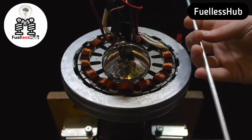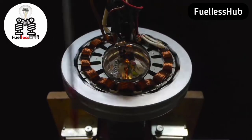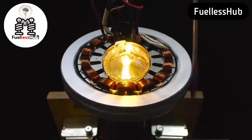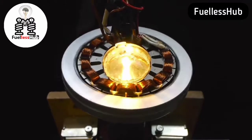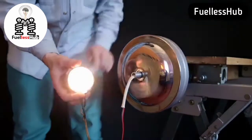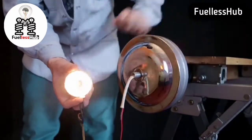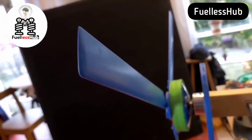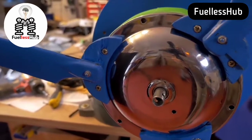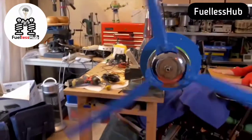The conversion from induction motor to generator had succeeded. It may not be the best generator ever, but with a little spin, this incandescent lamp starts to glow. Putting the two shells together again gives the generator body more strength. It is time to put some wings on it. I have some old RC helicopter blades that may work — a real airfoil and weatherproof. With the helicopter blades attached, it really starts to look like a wind turbine, though this experiment is far from over.